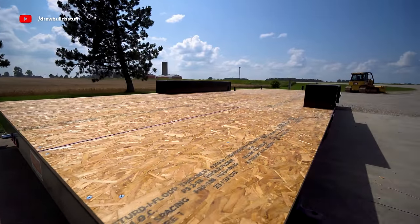Now before I install that starter piece, I'm just using this snap lock punch to punch a tab every 2 feet or so. And then just sliding that in place inside of that sill trim. After I made sure that piece was level, I nailed it off every 16 inches or so, and then continued adding pieces.